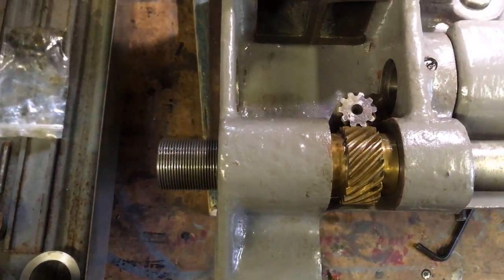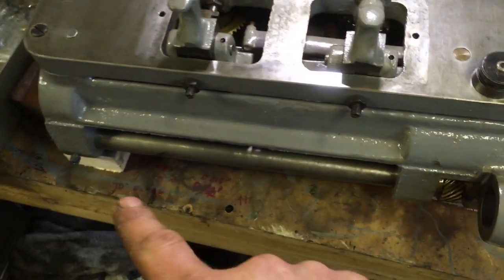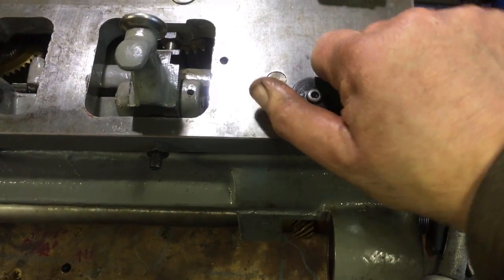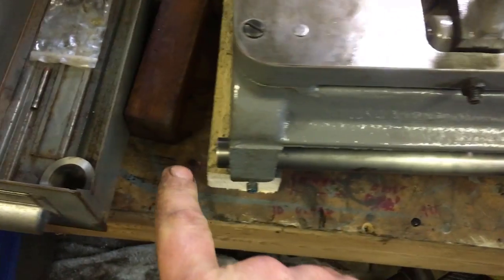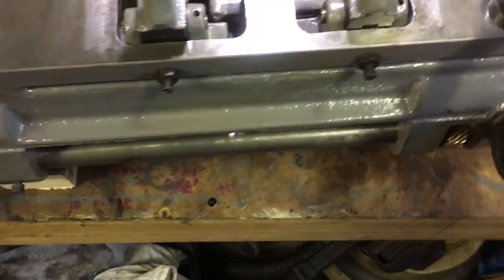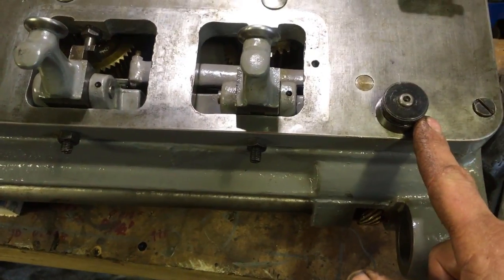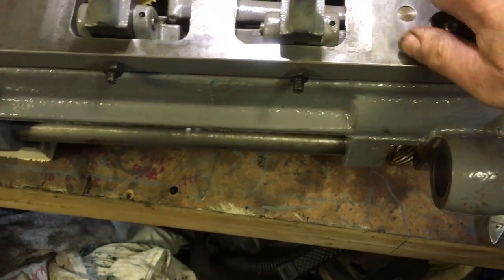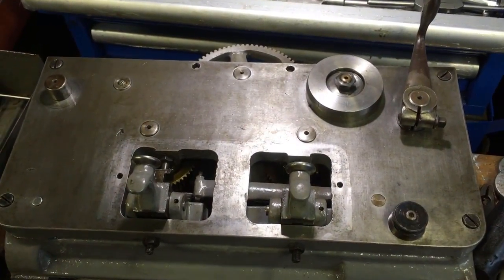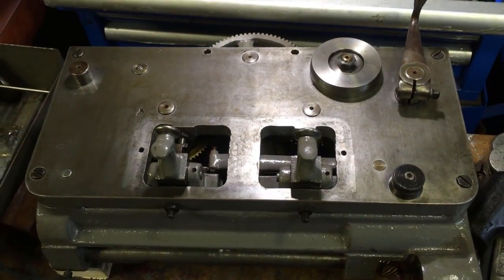Be interesting. So that's the adjuster put on, and that's got graduations 0 to 25. The thread on that thing is 20 threads per inch. And what I think's happening is, as you turn this, it's obviously adjusting that end, which is the end at the stop. So I'm assuming 0 to 25, and then thou. So you've got basically a thousandth of an inch adjustment. I don't know, about half an inch you've got in terms of throw. But yeah, complicated way of doing it, but there we go. That's the thread indicator. So just the handle to go on, and this guard over this, and then these two trips once setting up, which I'll do once it's hanging. Looks better than it did.